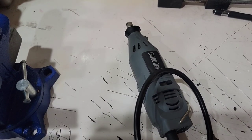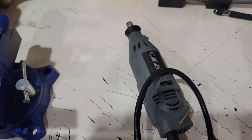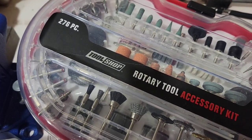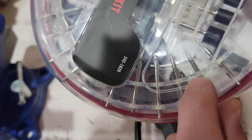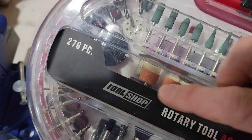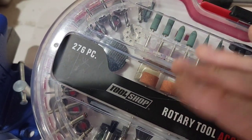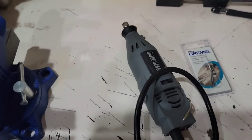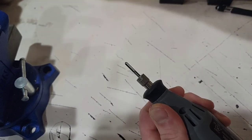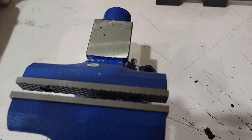Now with this one, because we're dealing with hardened steel, I'm going to use this carbide cutter. But you can get a kit like this and you have everything you need in here to actually do one. They have these little diamond stones over here — these work great. And then you can finish the steel off with one of the aluminum oxide stones. These ones are really soft, so you'd want to start with the diamond and then finish it off with one of these softer ones, and it'll clean the metal up to make it blend in. And then we're going to use a vice to hold the knife.